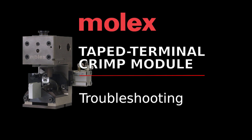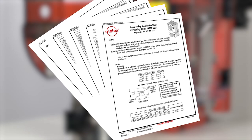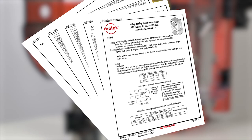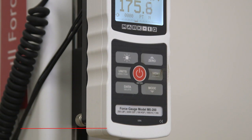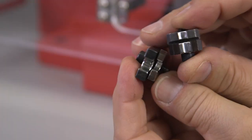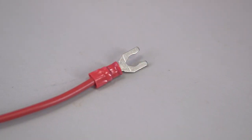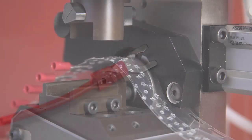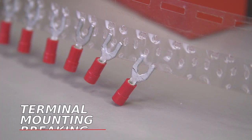We have identified some of the most common problems. If your crimping operation is not giving specified results, before making any adjustments, refer to the application tooling specification and manual to verify that the terminal, wire, and tooling are compatible. If your crimp terminals are failing the pull force test, check to see if the crimp dies are failing to bottom out or if they are worn. It could be that the wrong dies were installed, there is an incorrect die arrangement, or the tape mounting is incorrect.